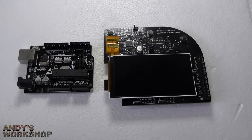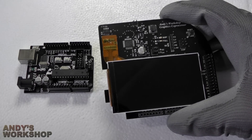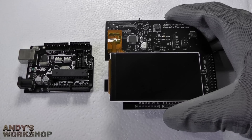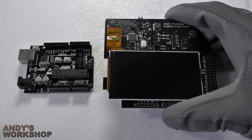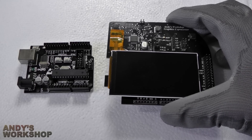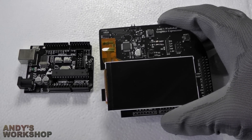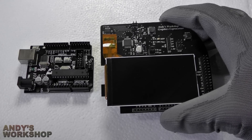The reason for doing this is that graphics processing is typically quite heavy on a CPU's ability, and the Arduino is not very well endowed with CPU power or memory. It's only a 16MHz MCU with only 32K of flash memory and only 2K of static RAM. So it makes sense to offload the burden of doing graphics operations to a separate processor, and that's what this project does.